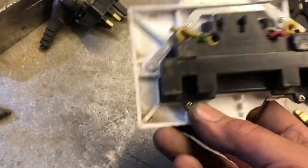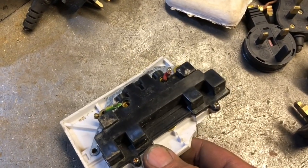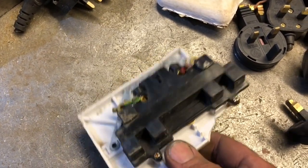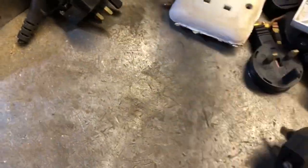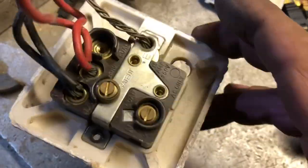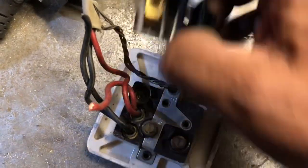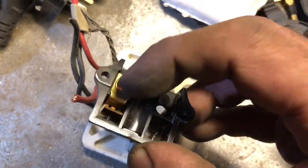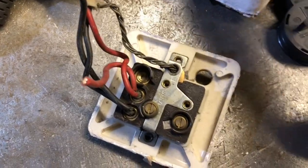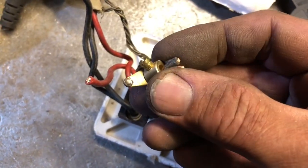A little brief chat about the socket side of things. They've been cheapening over the years. Here's a cheaper version and here's an old version — much more well constructed. All the holders are thick brass and copper components, with even big chunks of silver contacts on them.